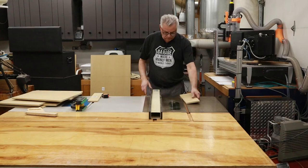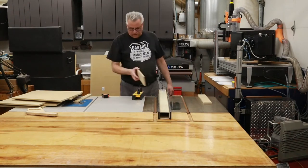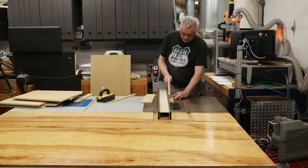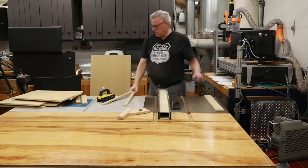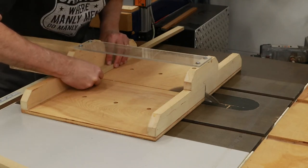After getting all the parts cut to their basic square shapes, next thing we got to do is pay attention to a couple of other cuts. On a center support that goes behind the filters, we got two little notches to cut out here. Bandsaw, perfect tool to do that. Of course, then again, if you got a jigsaw, use that.